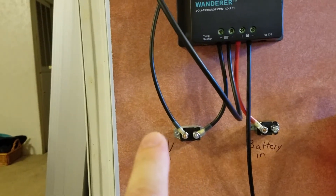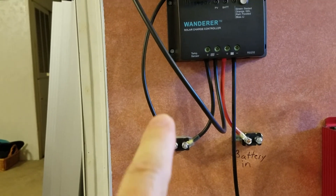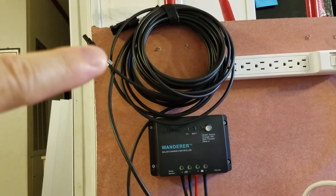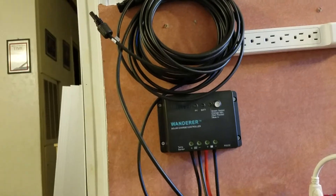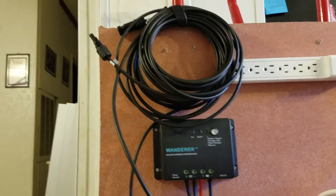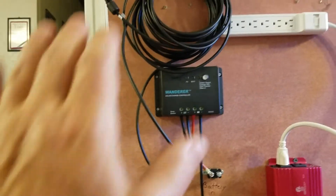As I mentioned in my last video, you really ought to have a switch — not a breaker — for your PV cables. You can see they're rolled up there. I'm going to have to unplug them and plug them in every day. So functionally, my switch is just unplugging them from the array and rolling it away into a shed, at least until I build a box.